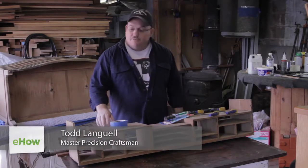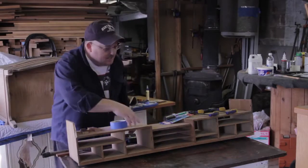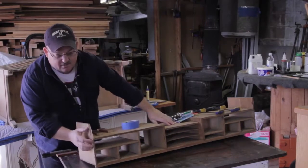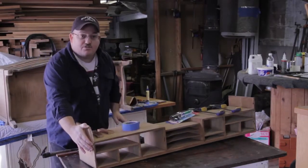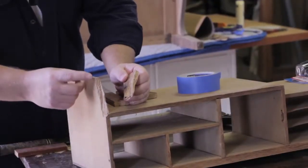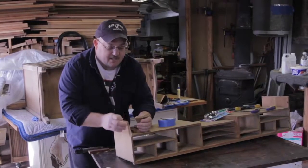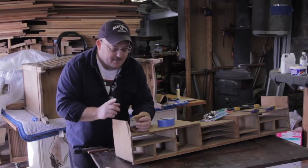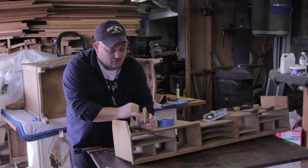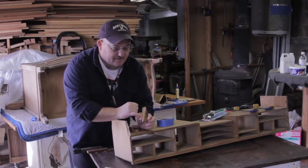Today I'm going to show you how to repair furniture with epoxy. Now, this is a cubby hole for a roll-top desk, and you can see here that there was an old stress fracture, and it just popped off during the stripping application. When you go to try to put this back together, don't keep fitting it in and fitting it out. You want to try to fit it in once and one time only. Because what happens is that during each test fit, you're realigning the wood fibers.